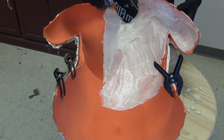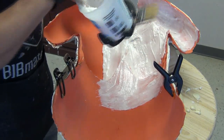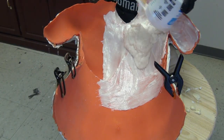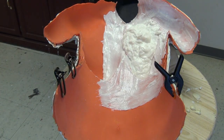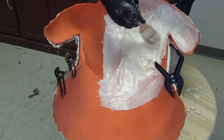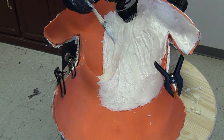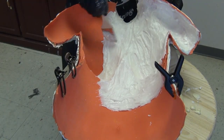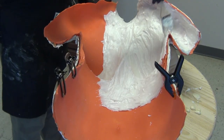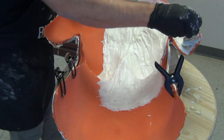Now this will set up really fast. You can see it's starting to get a little draggy, a little sticky. As soon as it does that, I need to leave it alone and mix up another batch. The reason I'm doing this in two layers is so it'll have a nice consistent bright white surface. If I don't do this, there's going to be areas where you can see that orange life cast silicone through the resin. When that's flipped over, you'd see some of that foam through the resin — not the end of the world since this isn't a cosmetic part, but for being able to see the pattern when sculpting on it, a clean white surface is much nicer and makes cleanup, sanding, and tracking a lot easier.